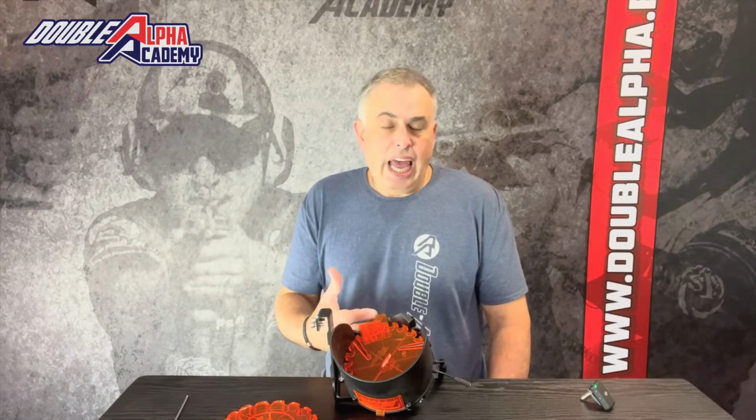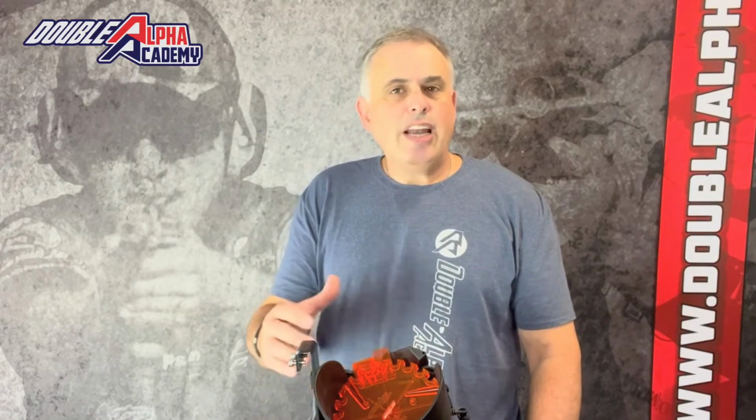The previous model was heavy on machined parts. We machined the base and the plates from PVC, and the sidewall was an aluminum piece. All of that machining came at a cost and limited the features that we were offering on the device. Last year we looked at this project, and we had several ideas of how we could make this a better bullet feeder. We redesigned the product, prepared it for tooling, replaced a lot of the machined parts with injection molded parts, and that change in design allowed us to introduce 10 or 12 new features and improvements that make this bullet feeder an even better product than it was in its previous iteration. Allow me to show you what makes the Gen 2 bullet feeder an improved product.